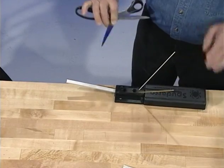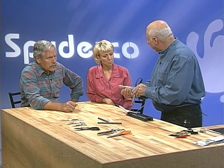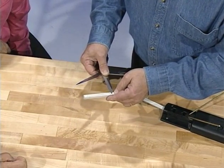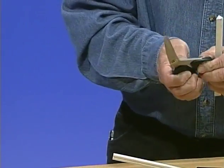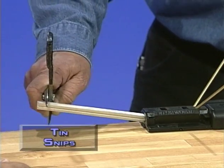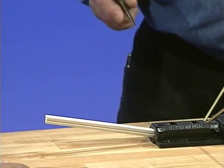Both shear blades are done the same way — just turn it over. While sharpening on one side as with kitchen knives, it's possible to develop a little burr. A lot of people just close the scissor and that cuts off the burr, and that's okay. However if you want to be more specific, lay the blade right flat on top of the stone and just cut the burr off — once or twice is enough, as long as the stone is flat against the shear. Tin snips would be done exactly the same way — blade straight up and down, drawing across the stone from heel to tip, both sides the same.